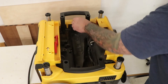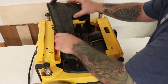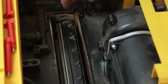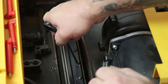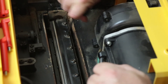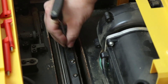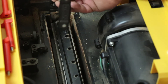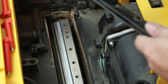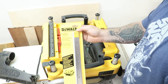First I'll remove the three wing nuts that hold the dust shroud over the cutter head, then I can take the dust shroud out of the planer. When you remove the shroud from the planer, it'll engage a lock onto the cutter head. Make sure that you push that lock down when you need to move to a new position. To remove the first knife, I'll have to remove the eight screws that are holding the clamp and the blade into the cutter head. The T-handle wrench that comes with the planer has two magnets on the back of it, so you can use those to pull the clamp and the knife out of the cutter head — this will keep your fingers away from the sharp edges.